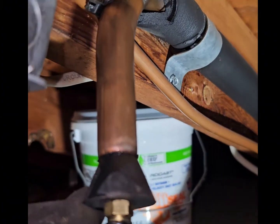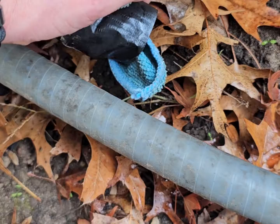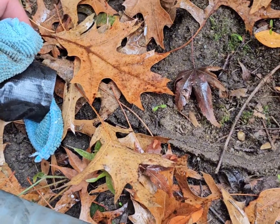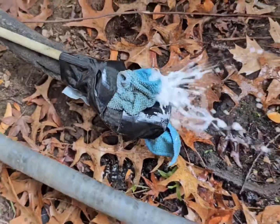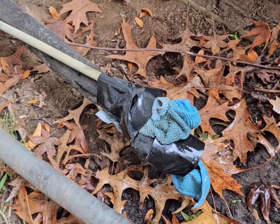Always wear safety equipment and flush both lines with about a half a can each. Now let's head outside and make sure it's coming out of our lines. We tape up and rag off our ends to restrict the lines a little bit so the pressure comes out a little stronger and we can get more oil out of the lines. After this is fully complete, we then purge our system one more time with nitrogen, and the job is done.